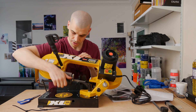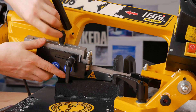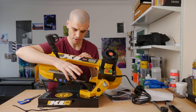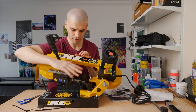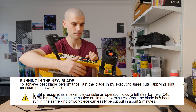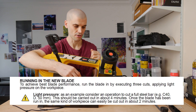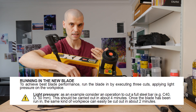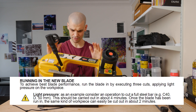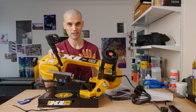You need to move the roller guide as close as possible to the stock you're actually cutting, just to ensure the blade stays nice and rigid and won't wobble around too much. From the images in the instruction manual, that's the one thing I can see I need to do. It also says in the documentation that you should run in your blade — basically it looks like for the first three cuts you should take your time. It gives an example: if you're cutting some steel bar, take four minutes to cut it; once it's run in, you can do it in two minutes. It's really not very well explained. But it looks like we can just turn this on and do a test cut — let's see what it does.